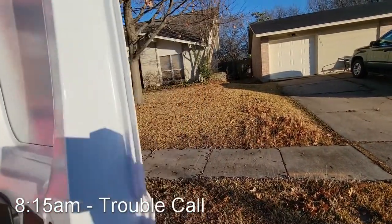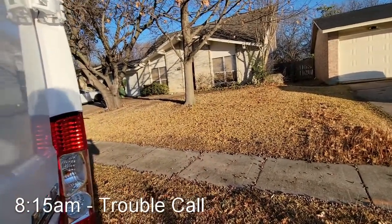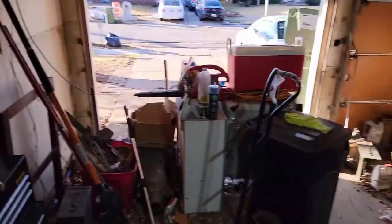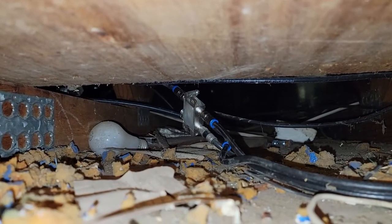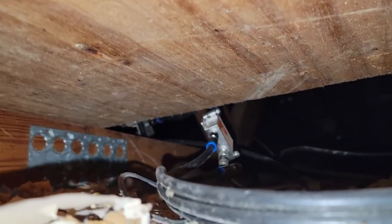We're here at the customer's house — it's a single-story house and I can see the cable on the outside, so it's going to be an exterior to interior penetration. I'm going to make contact with the customer and see why he's lost signal. There's no signal at the hopper. Can't access the attic, but looking up through this little broken piece I can see what looks like a hybrid solo hub and a splitter, so I'm going to replace the hub and see what happens.